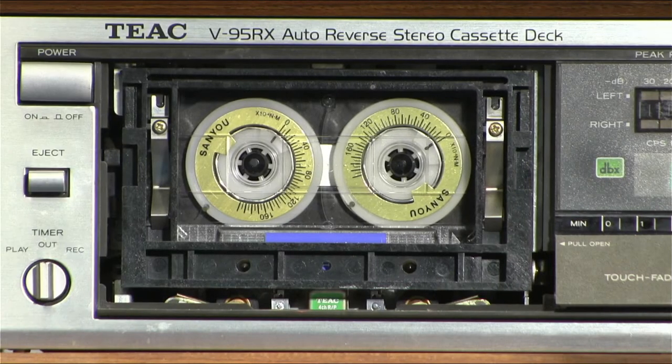So we use a device that looks like this. This is a cassette torque meter. It's a specially made cassette that has a torque indicating device built into it. It probably is a little coiled spring, and as the reel moves, it applies pressure against the spring, which is trying to unspring, and the reel is trying to wrap it back up, and it measures that resistance, and it's calibrated in Newton meters times 10 to the minus fourth.